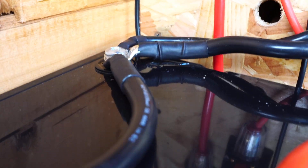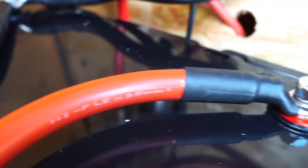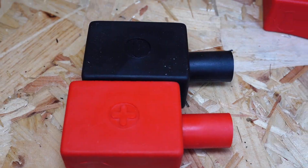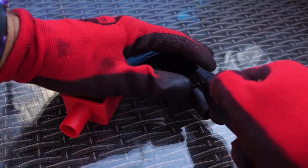I keep the two negative terminals connected together and keep the two positive terminals connected together, which will double my battery capacity to 200Ah. For where there were three cables connected, I used a slightly longer bolt. As I want the terminals protected, I use these battery covers and make slits in the covers to suit my setup.